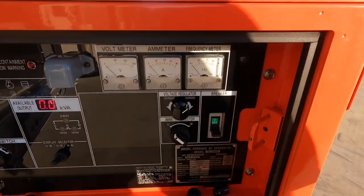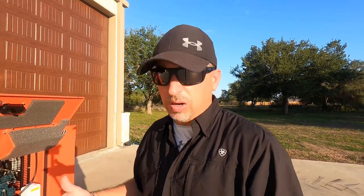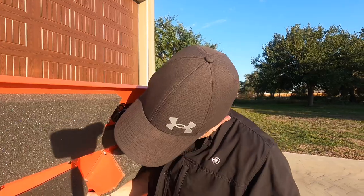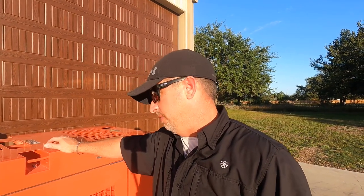You have to have that main breaker on when you fire it up — I usually wait until the generator warms up before bringing it on. Because it's 3600 RPM you hear most of the fan noise, but with the cabinet closed it's pretty quiet. The 1800 RPM generators are a little bit quieter — Onan makes a diesel one at 1800 RPM that actually uses the Kubota engine. It's a little bit quieter than these, but this one has more of a low-hertz sound. Up close you hear the fan and wind noise, but when you walk away it's not that loud.